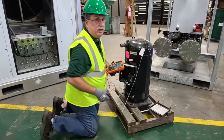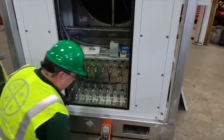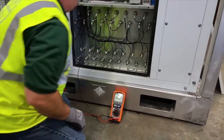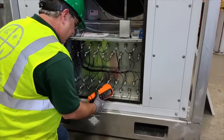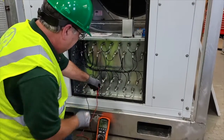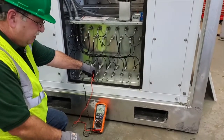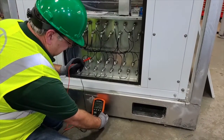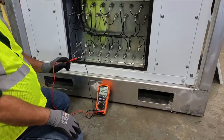So now we're going to do some heating elements. I'm going to take the ground lead and clip it to a good ground, and I'm going to test the meter again. I'm going to go anywhere to ground without touching anything else to test the meter. Again, you see the continuity in the meter. Now we're going to test the meter without touching — see it built up to 547, 4,000 megaohms. We've demonstrated that the meter is still working good with no problems.